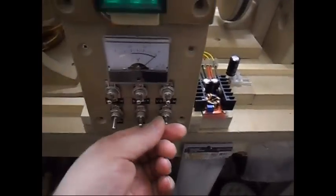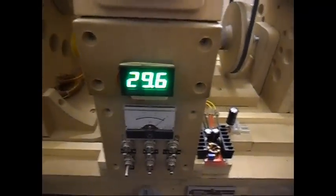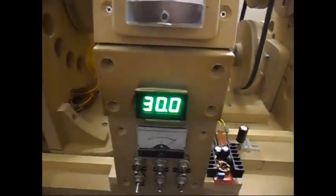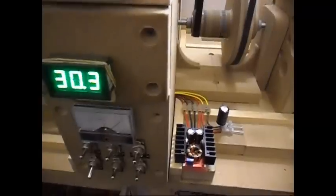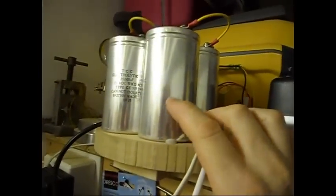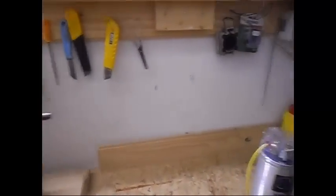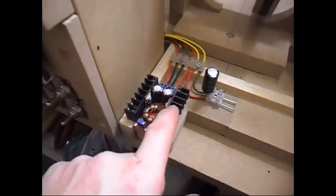Let me go for second speed. The reason why the voltmeter is higher when the system is driving than when it's not driving the rotor is because of the DC-to-DC converter — it's just trying to keep up with what the system is needing. This is also because I added large capacitors as buffer capacitors to the transformer. The transformer is connected to the grid to get roughly 15 volt DC, and that 15 volts goes to the converter, which I can adjust from anything from 18 to 35 volts.